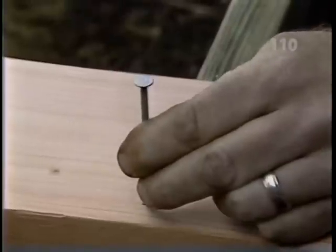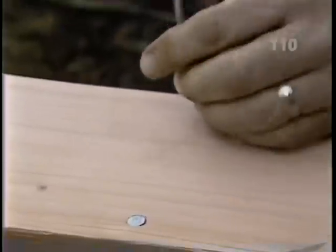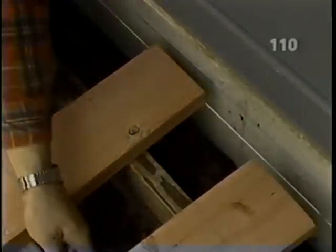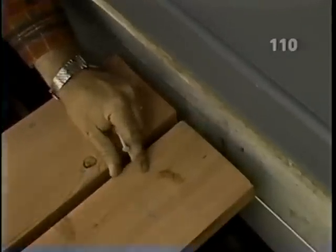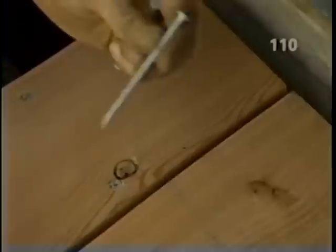To fasten the decking, we'll use a 12-penny galvanized box nail, which is a thinner gauge, meaning it is less likely to split the wood. We'll space the decking away from the house about an inch and a half, just using a line as a guide. That'll avoid any buildup of leaves or debris or moisture. Right, and we'll use a 16-penny spike as a spacer between the planks.